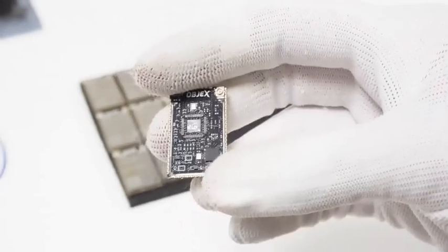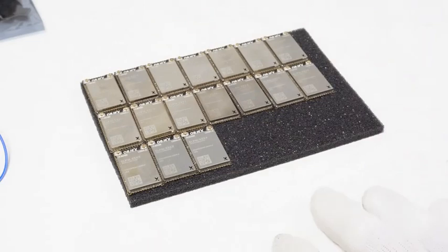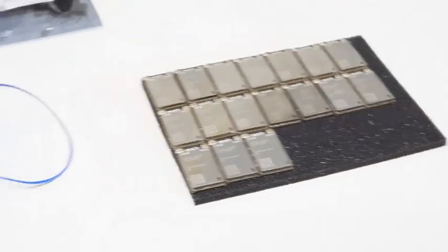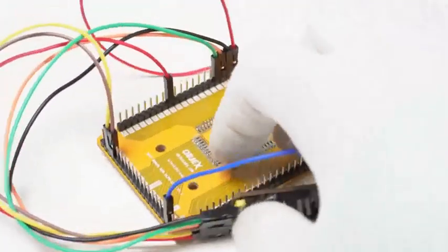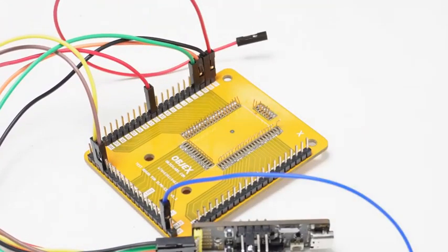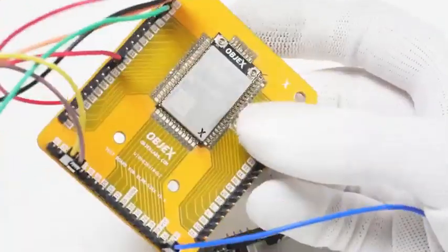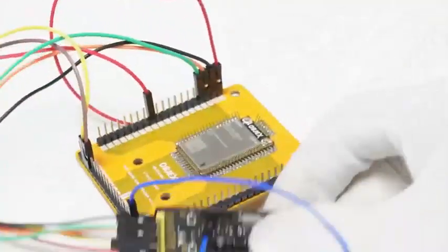These are the 17 modules from the panel, all soldered, now fitted with test shields for testing. Currently I use a fixture with flex pins where you insert the module into a socket. Then, through a serial bridge, I can perform all the necessary checks to do manual tests on these modules.